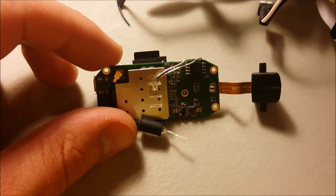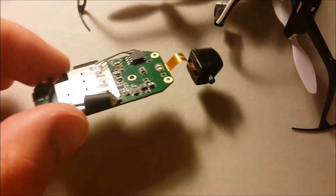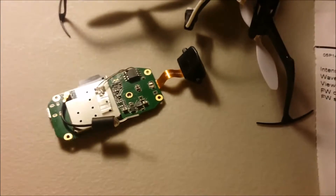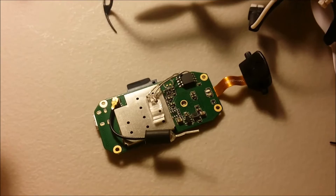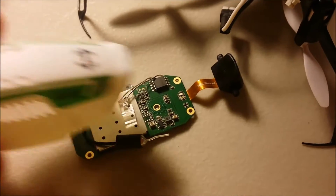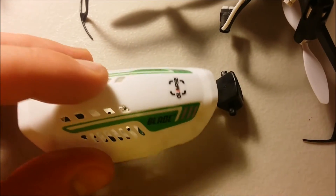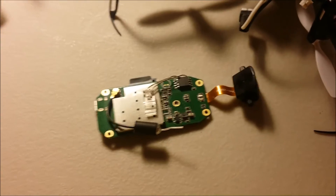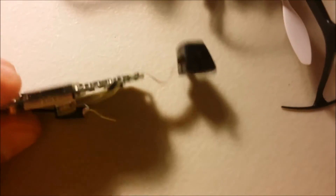You don't need any resistor with this one at all. You have to solder the LED on the bottom side, and then you bend it correctly to fit right on top of the SD card holder. Just make sure you don't let the two metal lines going to the LED contact any other metal, and it will fit snugly underneath the canopy.